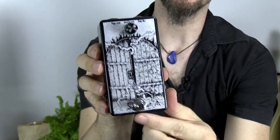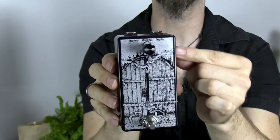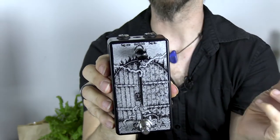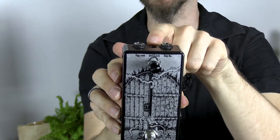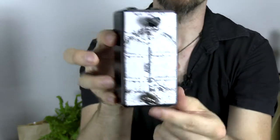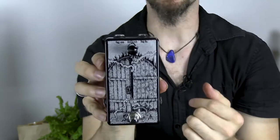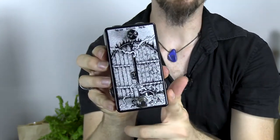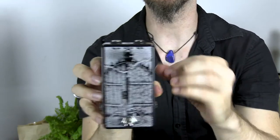There's the on/off switch and sign switch. Here's the threshold knob which controls when the gate opens and closes. We have the key in and key out, and here's the connection for the power supply — 9 volt. We have in and outs for the gate, and how this all works and how you connect it I'll explain later. By the way, it's a true bypass and everything is analog based.